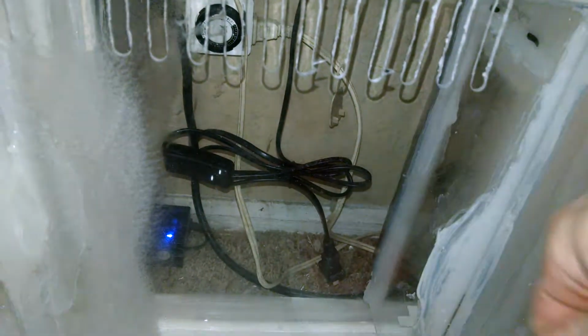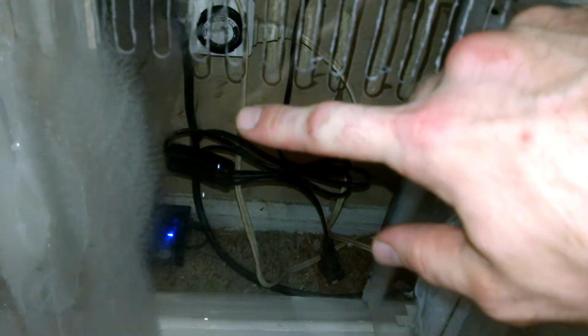Next thing was working with plexiglass. Silicone doesn't like to stick to it. You put silicone on a nice sheet of plexiglass, put your other piece of plexiglass on it, and 48 hours later it comes right off. You can take your finger, and it just peels right off. So I recommend sanding all your edges. This one I sanded a little bit too far out, so excuse my handiwork, and I used permanent marker. But yeah, I recommend sanding all your edges.